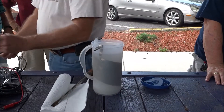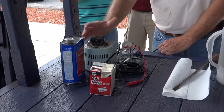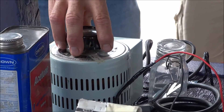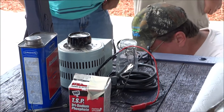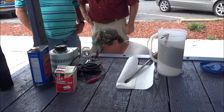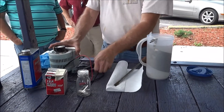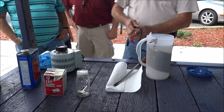The next thing here is a variac. I don't know what these things are made for primarily, but I know people were using them in TV shops back in the 60s and 70s. It's just a transformer — puts out from zero to 120 volts AC current. I'm going to run this off of a voltage inverter. We had to improvise electricity out here, so we're using a battery to an inverter to AC, and then it gets converted back to DC. So it's DC to AC to DC.